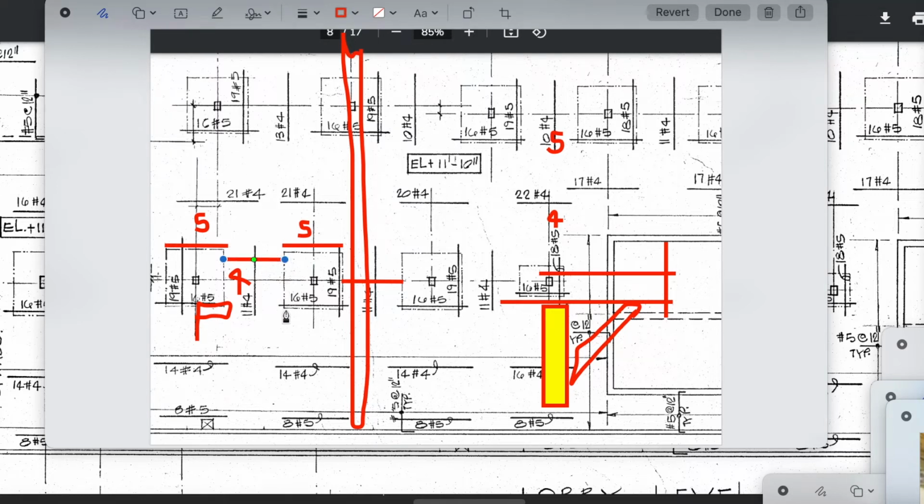I'm just going out to the edge of here's the box. See the box? And the box there. Now I'm going to give you some sag between it. Not much, because the span is, you can see this is much shorter within the span back here. So from here to here, remember my cantilever effect says it sticks off the wall approximately 4 to 5 feet. Down here it's about 5 feet where the deck takes a different fracture plane. And up here is about 4 in that direction. And so this is the area that I'm going to say has the deflection. This area right in the middle here. It has the deflection. It ramps up, if you will. It starts pulling on each one of these zones here. In this case, this is supported by this head.